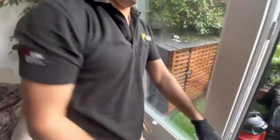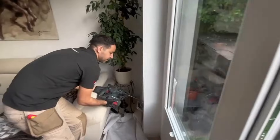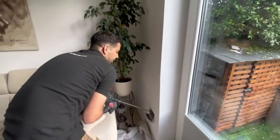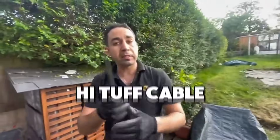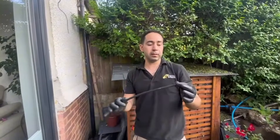As you can see from here, if you look on the outside you will just see it come through. Let's take the hole out — it's done. What we've got here is I'm using high-tough cable, that way I don't have to use a conduit through. This is a protected cable and that way I don't have to make a bigger hole of 16mm; I can use only 10mm and put this through.